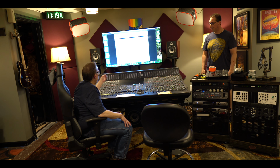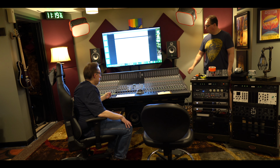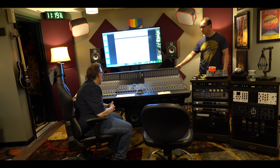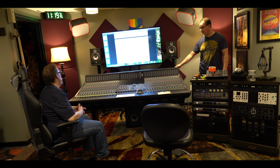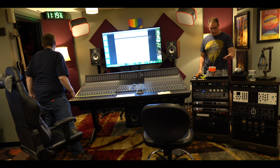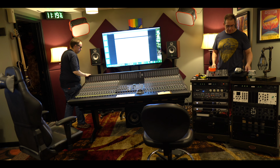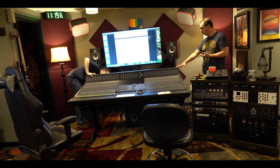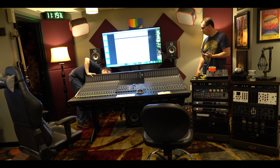And no matter what, we're going to be back patching in cables all over. My guess is probably not more than another eight more. If it comes over to the patch bay, then everything would be from the gear to the patch bay. There's the stereo group, the groups, and we don't need the actual group outputs, we need the group inserts. So that's two D-subs. So you've got a group insert point. That's two.